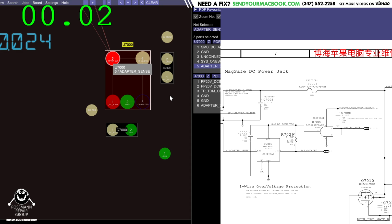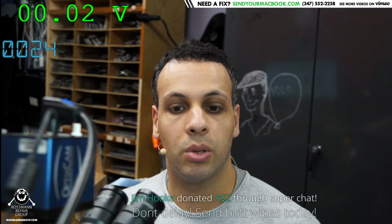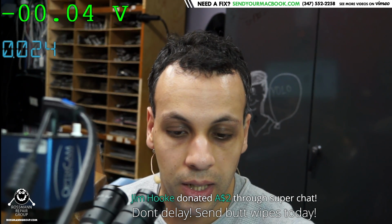Now that means there could be a number of things wrong with this. Behind door number 1, the DC in board could be bad. The DC in board is what's going to allow adapter sense to communicate with the machine.